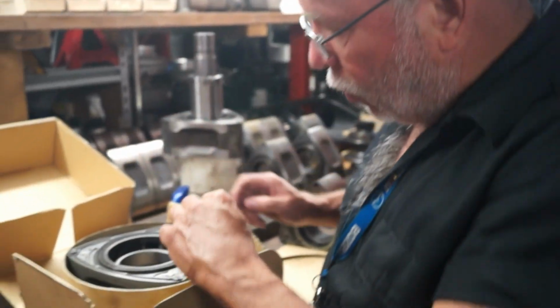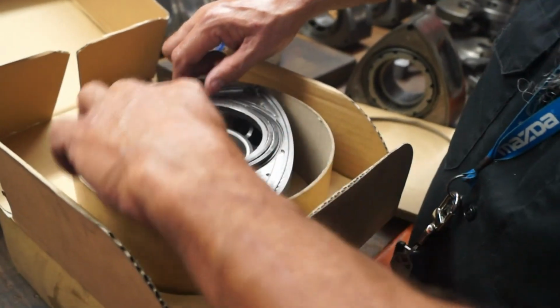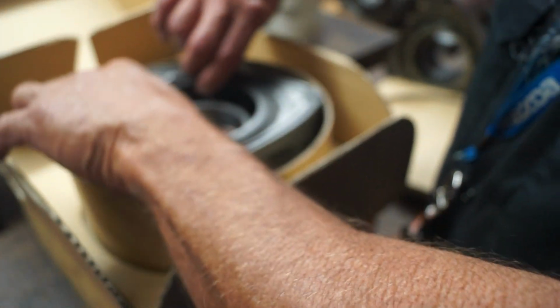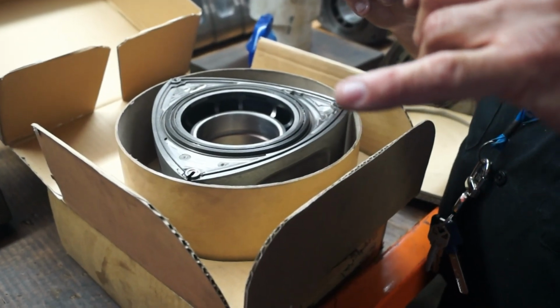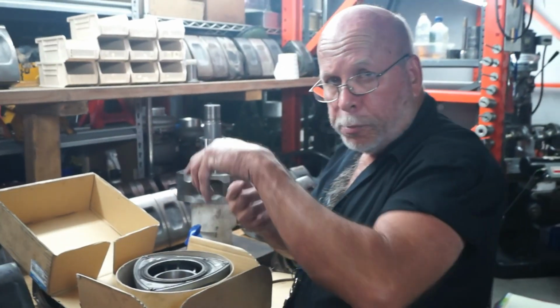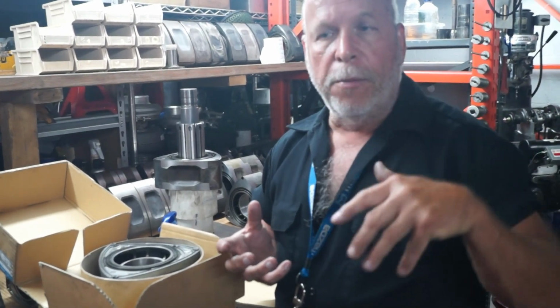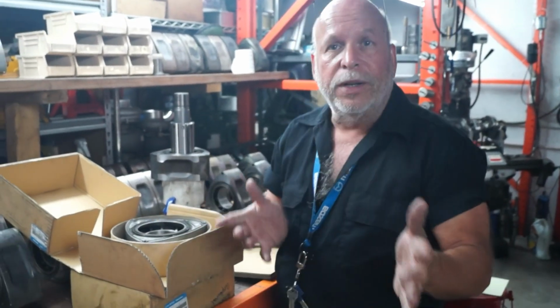I had to come in here and go all the way around. See? Yeah, I see the shiny. You see it everywhere. So when you're doing an operation like this, it's much simpler because you set the machine up, you tilt the head, you go in, you spin it, go in again, spin it, remove an amount that you feel is substantial, take it off the mill, blow it all out, clean it all out, and weigh it. And then I say, okay, well, then I need to go a little bit deeper, or a lot deeper. But it's what it takes.